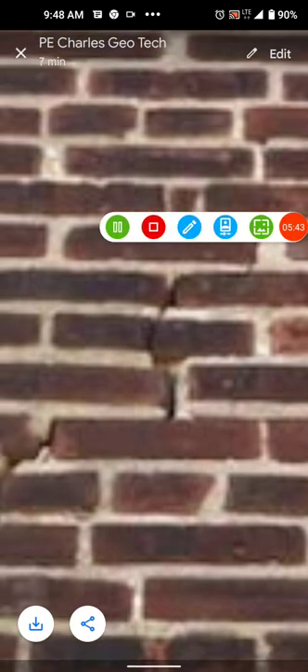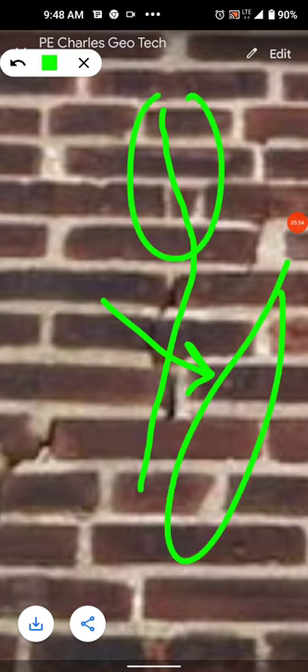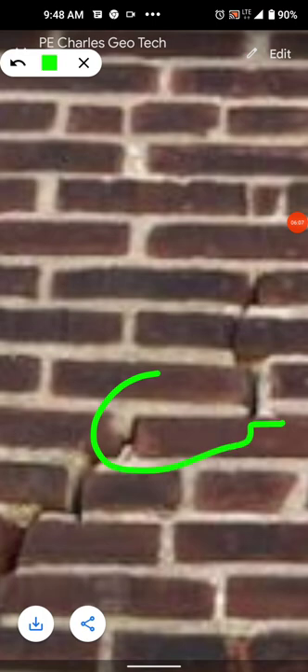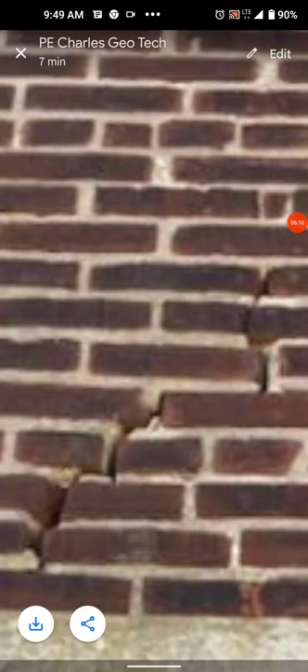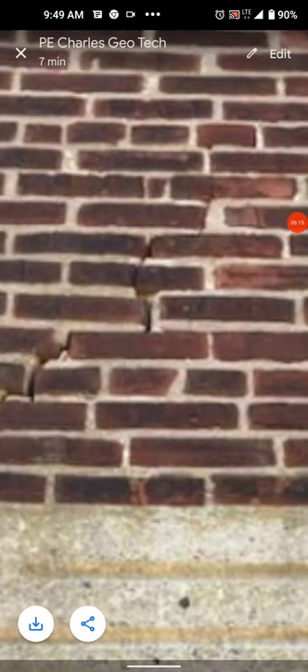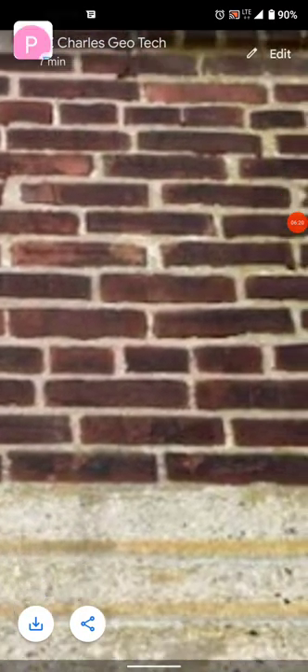The problem is the whole wall is being bowed out. Looking at it right here — this wall is now bowed out. From the side profile it would look a little like this — I'm exaggerating — but this part here would be the plane of the building and that's the bowed part. The joints have a nice rotation on them. The joints are pretty open now. That impact was so strong all of this would stay bonded.